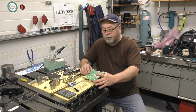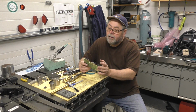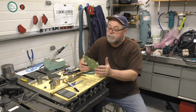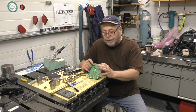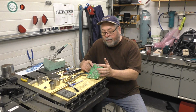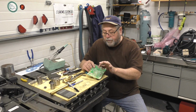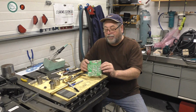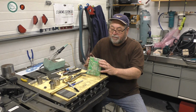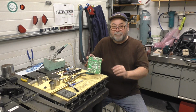So I pulled this board out and yeah, I found a couple cold solder joints. One of the capacitors just shook completely loose, so gotta fix that. Found the main incoming power to the relay that turns the rear fan, the blower fan on, had a bad joint as well. So I had one over here a couple of years ago and just loaded it up with some solder, then cleaned it up. So today's little job is to clean this little relay post, so I can get my heater working, or else I'm not working in the shop because it's too freaking cold.